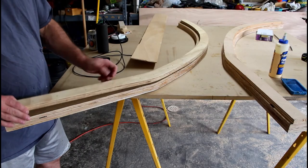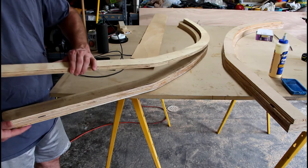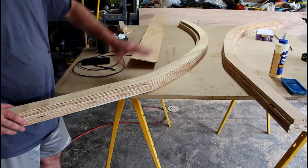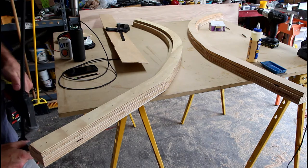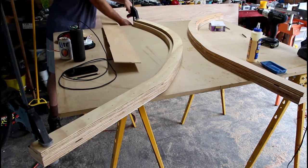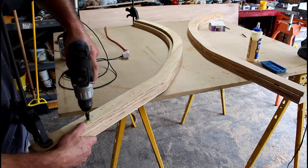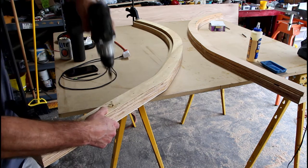The first thing I'm going to do is take this three-quarter-inch piece and attach it to the outside rib here. I'm going to put some glue on this back side, then countersink some screws throughout the entire board. I'm going to throw these clamps on to secure it while I'm countersinking. Got my countersinks done.